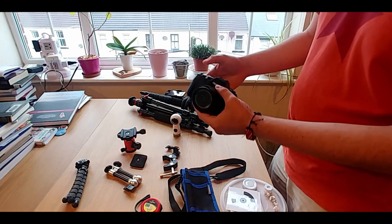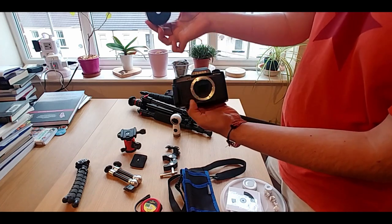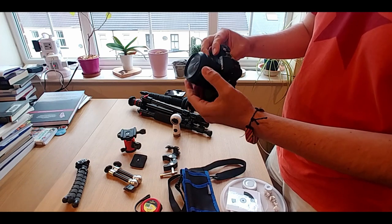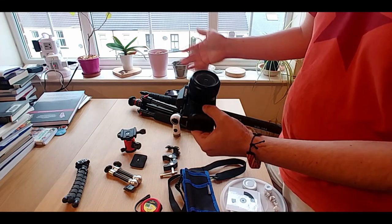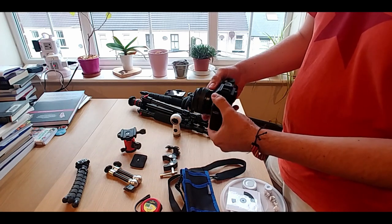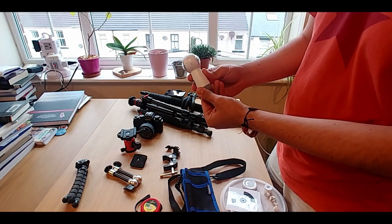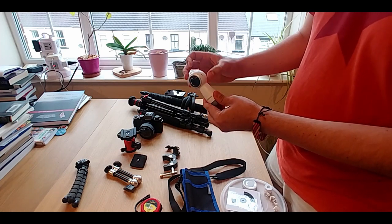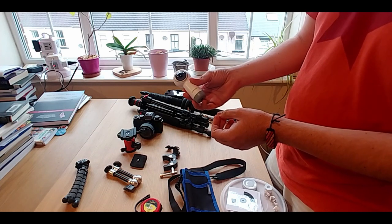In this case I am using this camera. It's a four-thirds camera with an interchangeable lens, so you can use any kind of lens. I use this 15–45mm lens, which is kind of a wide angle — very handy to cover more area. It's not a fisheye lens, but wide enough to cover a big area. You can also use 360 cameras such as this one, though this model is not the best for producing a photogrammetric model because the camera quality may cause some stitching problems. But you can use these cameras to produce a photogrammetric model as well.